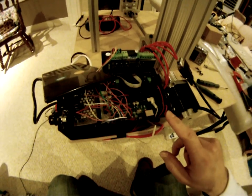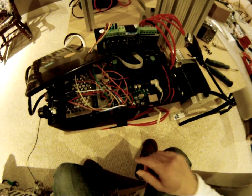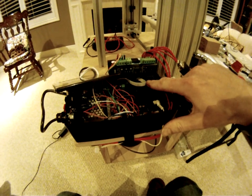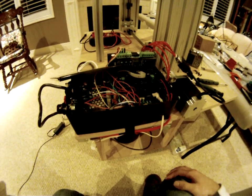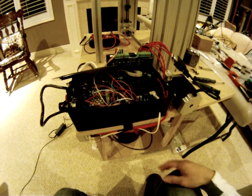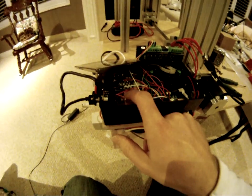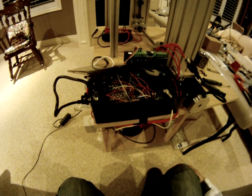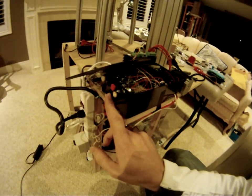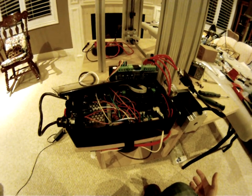On the inside you can see the brains of the operation — the Arduino. You can see the .NET Gadgeteer relay, which controls the on/off positions of the vacuum and the heater. Over here is a large rheostat, which is connected to the knob in the front for controlling the amount of heat that the heating elements give off.